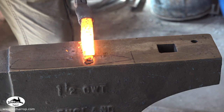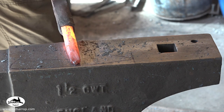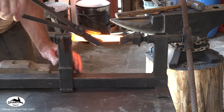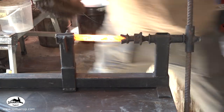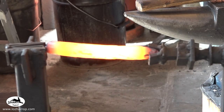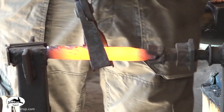Okay, let's round off this billet and make ourselves a little cigar shape — a hot cigar. It's got a taper at each end so it will go into the twisting rig. You'll see in a second that the left hand side is not quite tapered enough — it's not far enough into the holder — because it just kind of starts twisting itself out. So I've got to put that back on the anvil and taper that in a little bit more.